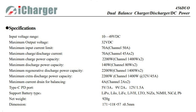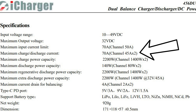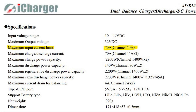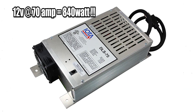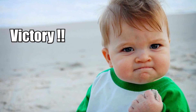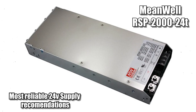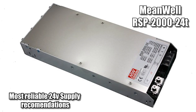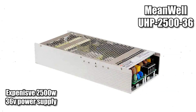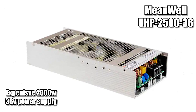Both chargers are listed as having a 45 amp charge rate on both channels. They also have a higher input current, which means you can use a lower voltage power supply and still get away with pretty high charge rates. This is a big win for everybody trying to get by with their 12 volt power supplies. It is still best to run a 24 volt supply if you need 1500 watts of output, and if you need the full 2200 watts, you will need at least a 32 volt power supply.